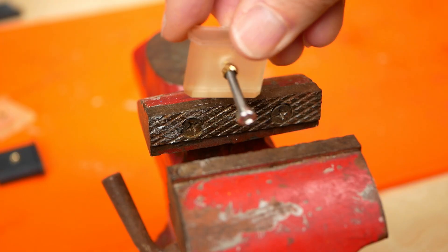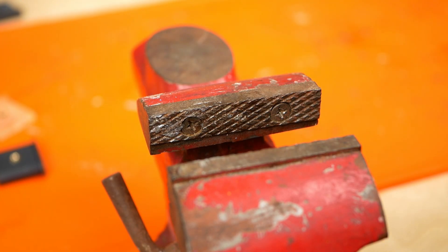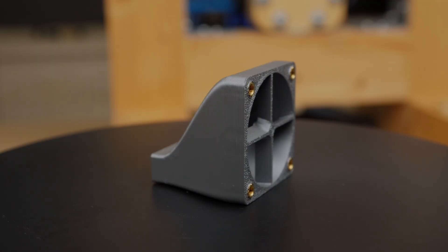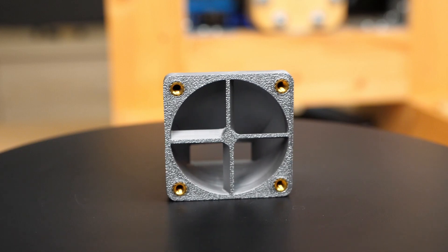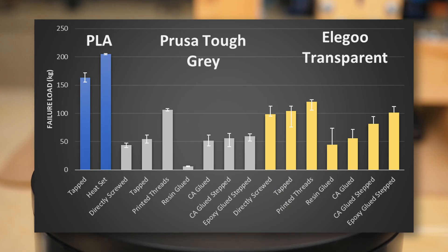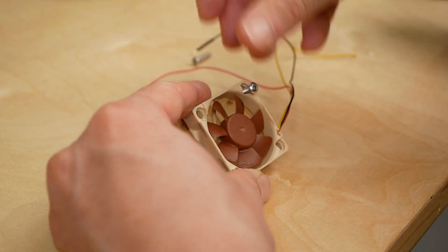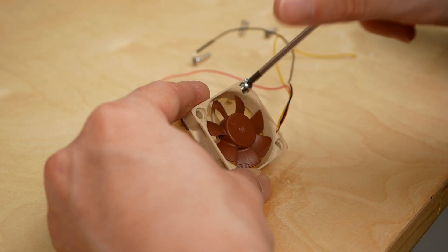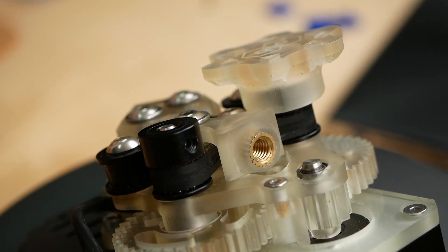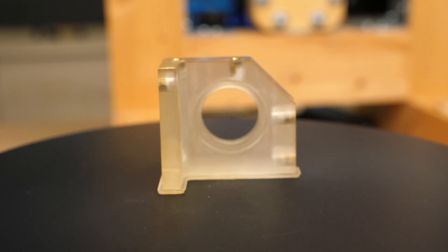Even though epoxy showed slightly better performance, simple thick CA glue is way easier to use, so if you don't need maximum performance, I'd still recommend superglue. The adjusted hole geometry notably improved usability and strength of heat-set inserts in resin prints, and if you're using our inserts from cnckitchen.store, you can find the hole dimensions on my website. In the end, heat-set inserts cannot only be used in FDM prints — with the proper glue and geometry, they'll also work in your resin prints. The main purpose of threaded inserts is to give you a more reliable, repeatable, and durable way to assemble and disassemble your parts, and as the Proper Extruder shows, this is even possible in resin parts with the right method. What are your thoughts? Have you used heat-set inserts and will you use them in resin projects? Leave a comment below!